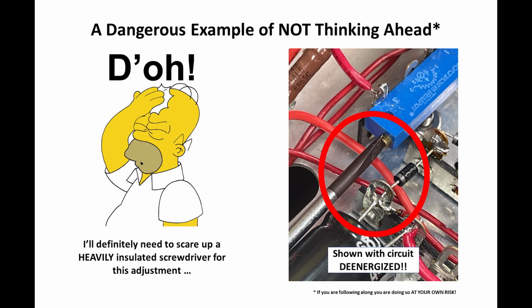By the way, the B plus voltage was also reading low, and we're going to do a similar modification with its calibration resistor. I'm going to put a pot in series with a new calibration resistor so that I can adjust the voltage on that indication too. We'll see that when we get there. That'll probably be in the next video, though.